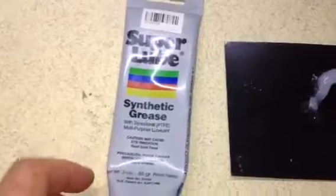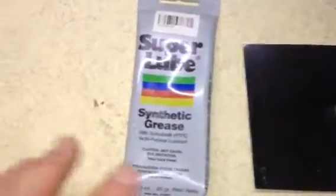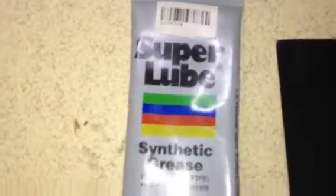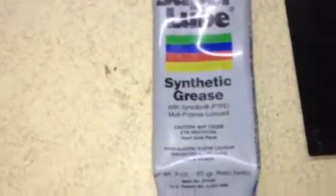So we're going to talk about grease for the pivot bearing and grease for the steering bushing up here — I just did a video on how to tighten up the slop, and it's beautiful now. Let's talk grease. For the pivot bearing and the steering bushing, I greased them both. I use this Super Lube — it's a synthetic grease. Seems to work well. When I did that pivot bushing, I put lots in there and I even greased the O-rings, and it works really well.